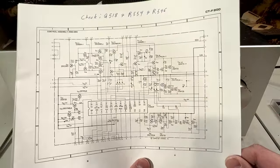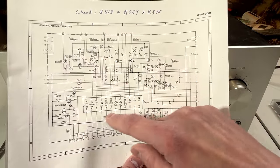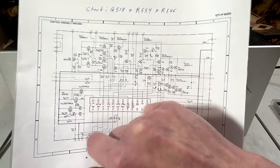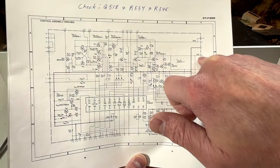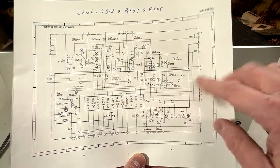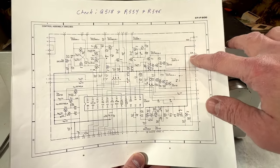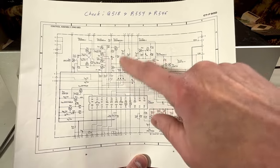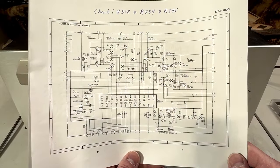What really happens to this unit when playback mode fails is that this VDD - the power supply to the control chip - it runs at 5.3 volts and originates on pin 10. I found that at pin 10, when you go to hit play or pause on this thing - because they both do sort of the same thing on this unit - what happens is this voltage goes to nothing. Zero. It completely bottoms out. So because that voltage goes to zero, playback never starts. And figuring out why it was doing that - that was the pain in the butt.